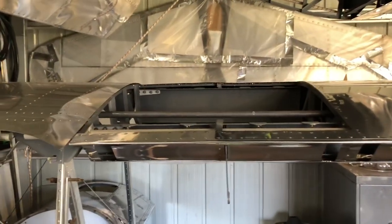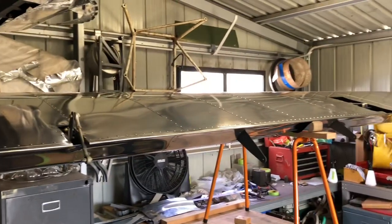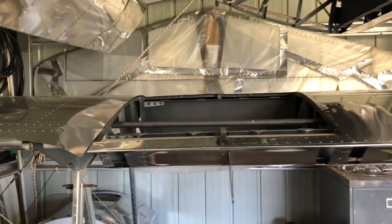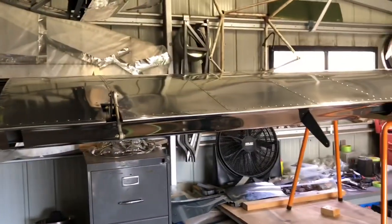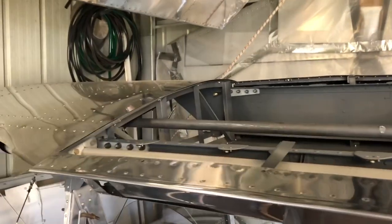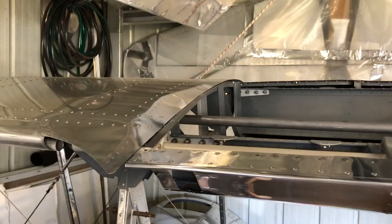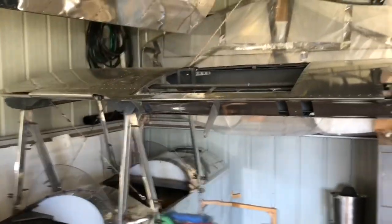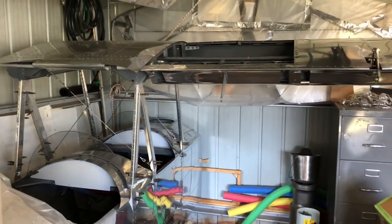At the moment I'm looking for a little bit of dihedral — maybe a degree or half a degree, just to stop the wing looking as though it's drooping. We've got our two degrees washed out. I've just got to set the wing and drill off the tangs so that they lock that in. Then we'll work on the struts, going from there out to this little bit here on that wing. Then we'll rearrange the shed again and do it on the other wing. Hopefully it all matches up — that's the goal.